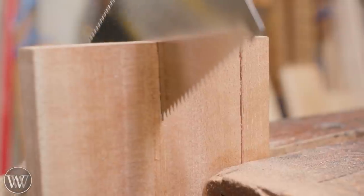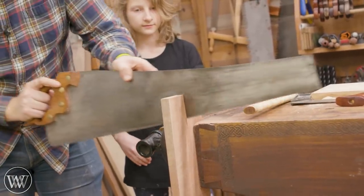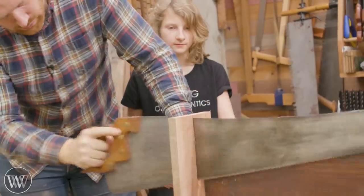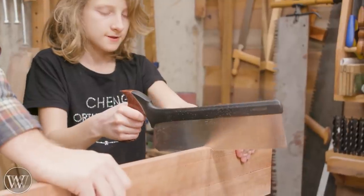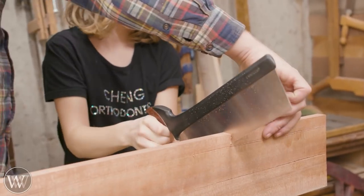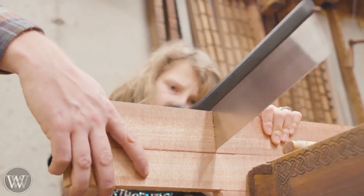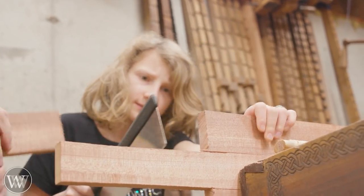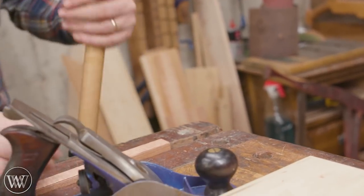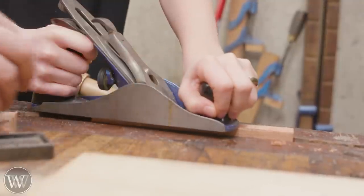Japanese saws aren't easy to turn — it's okay, it's good. So I'm going to use my saw, bring it back onto the line. On this side we're really close to the line, but this side we need a lot more. So when we plane it, we want to make sure that we're leaning on this side. Now you're trying to lean too much this way — we want to keep it flat. There you go.